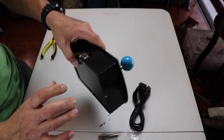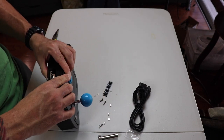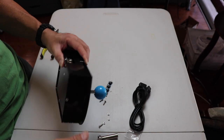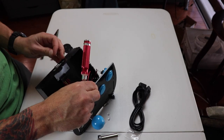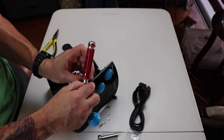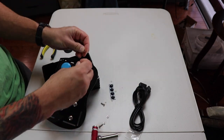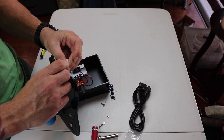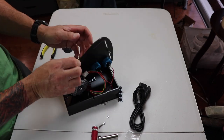Now, believe it or not, the most challenging part of this project was putting the top cover on because, like I said earlier in the video, now I can't get my hands in there behind each panel to hold the nut before I screw the screw in. You'll see I try to hold the nut with the needle-nose pliers, but they're too thick to go all the way inside the hole and hold the nut perfectly aligned. I try putting the nuts on the bolts first and sliding the top cover on that way, but that doesn't work. I end up taking the nuts off and doing them one by one the hard way, aligning the nut in the hole and then matching the screw up with the nut and getting it started. So the rule is just take your time, don't lose your patience, and eventually you'll get them on.